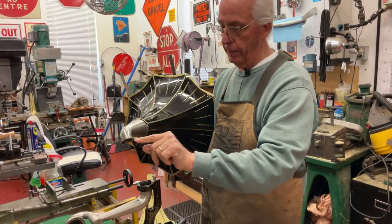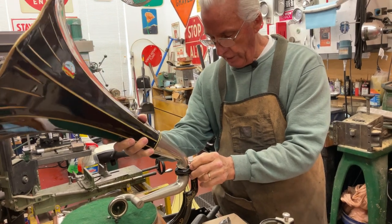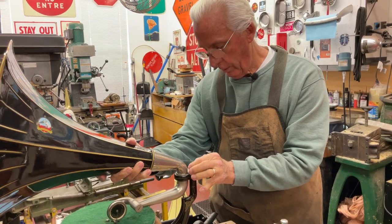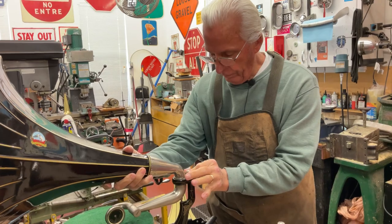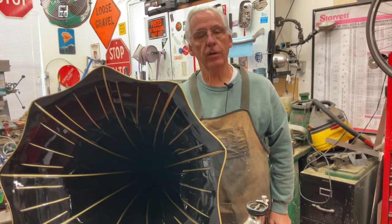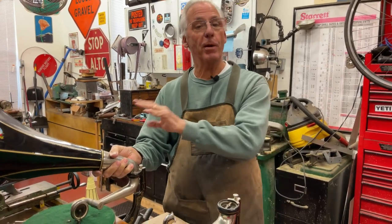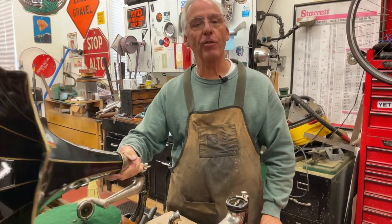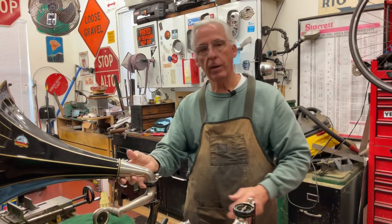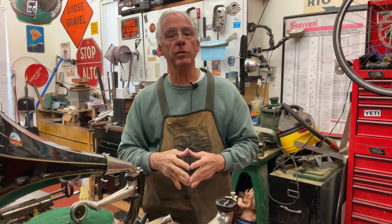On the yoke, we have a flatter side and over here a thicker side. This flat side, the shortest piece, fits in like that. Then you hold the horn and crank down — there we go. That's designed to let the horn pivot. So if you're playing your phonograph and Aunt Julie doesn't like your music, you just turn the horn this way so you can hear it better. It's a directional thing for the horn, which is really nice. That's my tip for the day on the difference between the yokes or elbows on Victor machines.